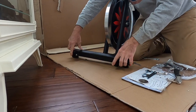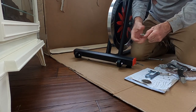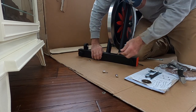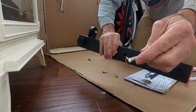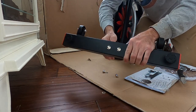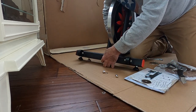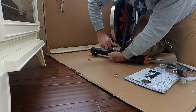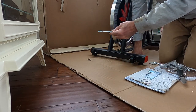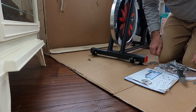And then the same thing on the front. On the front, you want to have it so your travel wheels are facing forward. Same thing — take your acorn nuts and washers off of your carriage bolts and slide them in. You can see that hole is square and you've got square on this carriage bolt, so when they go in the hole they can't spin, and that's how you're able to tighten that nut down. Washer, and go ahead and put your acorn nut on there hand tight. Now they're both hand tight — get your 13 millimeter wrench and just snug it down. And that's that. Now your feet are on.